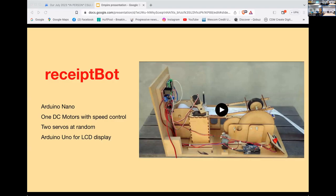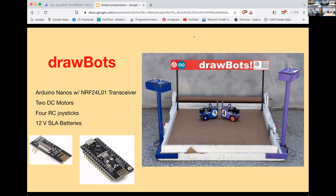Over the time I worked on those machines, I developed a real admiration for the guys who support copiers. I have old IBM Selectric parts that have been sitting on a shelf. I'd love to do something with that, with the big rollers. Yeah. If you look really carefully, you'll see that where the little rollers and the big roller are, there's a big heavy metal plate on each end that supports them to make sure they stay aligned. Okay. Yeah, I think bigger paper would be a lot better. Right, because if the rollers misalign, paper jam. One degree makes all the difference. Oh, yeah.